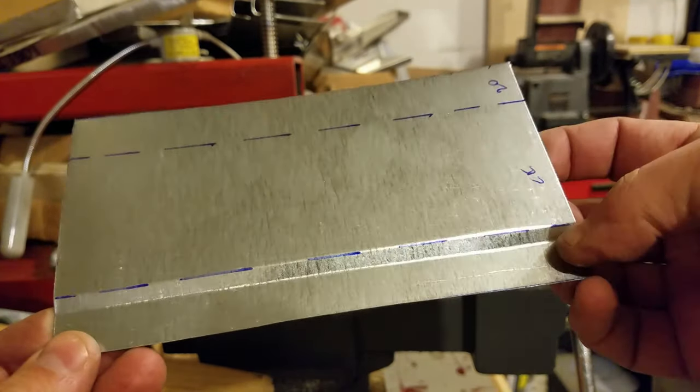To finish this part off, we simply measure 15 millimeters over from this edge and trim it. This other side gets trimmed all the way down to the edge of the joggle — the whole flange comes off, you just want the joggle end on there. That's what will bump up against the center nose gear channel. In my firewall video, I'll actually explain why I don't mark the holes or slots on this yet, because there's some final locating and positioning you have to do. But this is how you get the base part, figure out where to put your slot, and do the finish work. That's essentially how you do a very simple joggle — it turns out really nice. Thanks for watching that tooling tip and we'll see you next time.